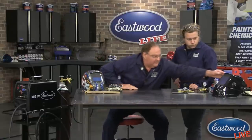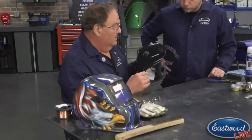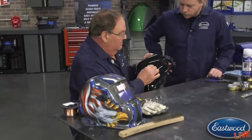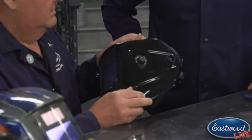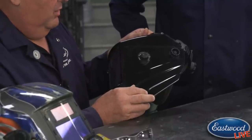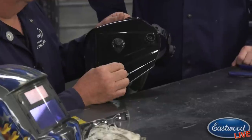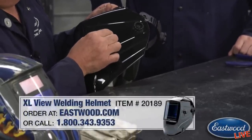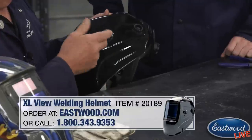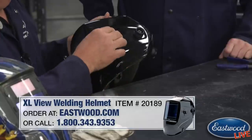The very first thing I teach is safety. A good welding helmet is important to have. This is a large-view auto-darkening helmet that Joe's going to be using. When you first start out, I tell everybody to put it on setting 11 — that's the middle of the road. If it's too bright while you're welding, you can turn it down by increasing the number, which makes it darker. This helmet also has a grinder feature — do not click it to grind because it will not darken.